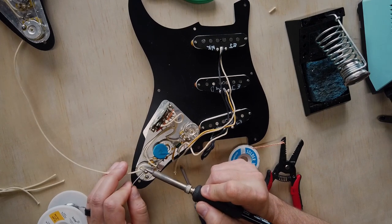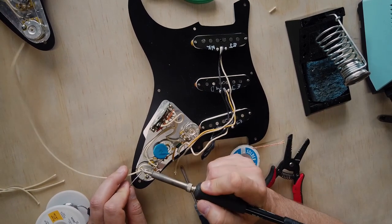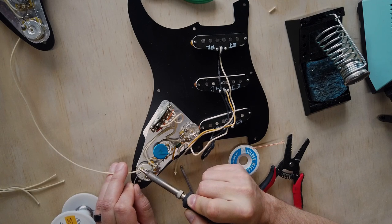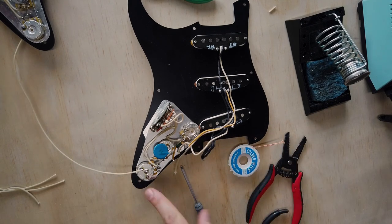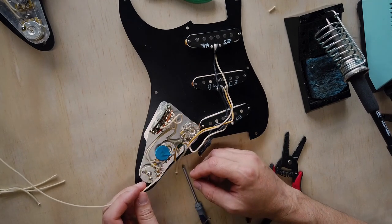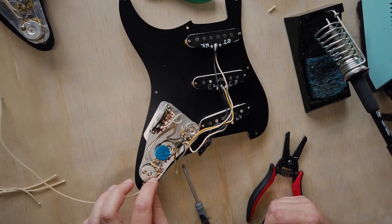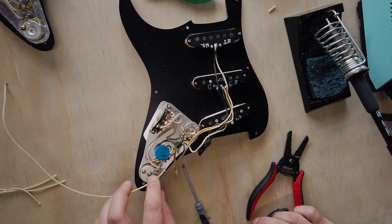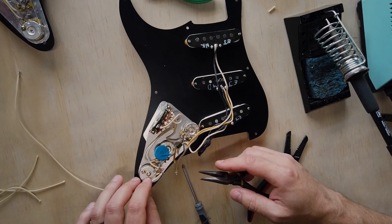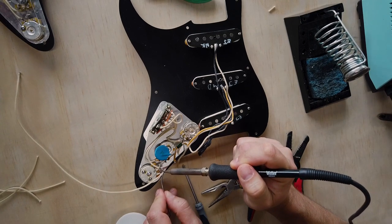What I want to do is make sure I'm flowing, getting the temperature up on the iron, making that contact smooth, and then the solder flows out nice and easy. Going into the lug, just sticking it in there is okay if the wire is secure, but if it's moving around while the solder is cooling, you're going to end up with a bad connection. So if that's a problem, just put a little hook in the wire and loop it into the lug so it doesn't move around on you. Then you can come in and make an easy connection.